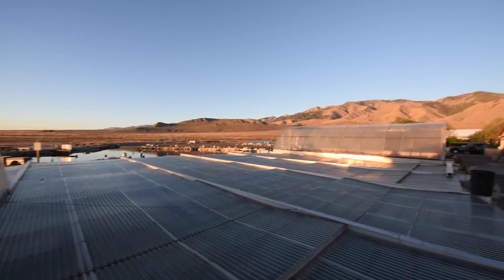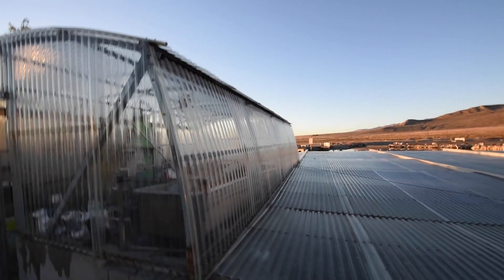That 40 PSI is running about 75 gallons a minute of water. By the time you inject the air, you're right up to about 150 total gallons of fluid with the air-water mixture. By my calculations, there are 150,000 gallons of water in just this smaller bay. If you turn and look over there, there's a larger bay, and then the round section back behind — add it all up and you have right about 2.7 million gallons of water. As far as this first bay, assuming you were just pumping the water straight through, it would take two days to cycle that much. Given that you're recirculating it, it should take four days to process 85% of the water. I hope to come out here in another month or so and see just how well this thing has worked.